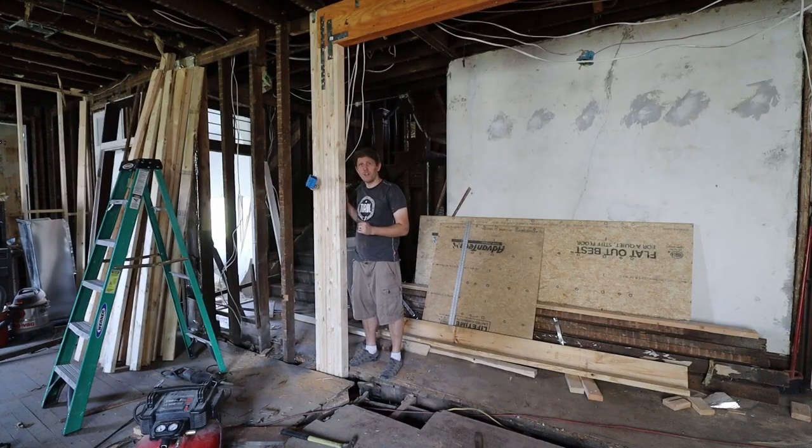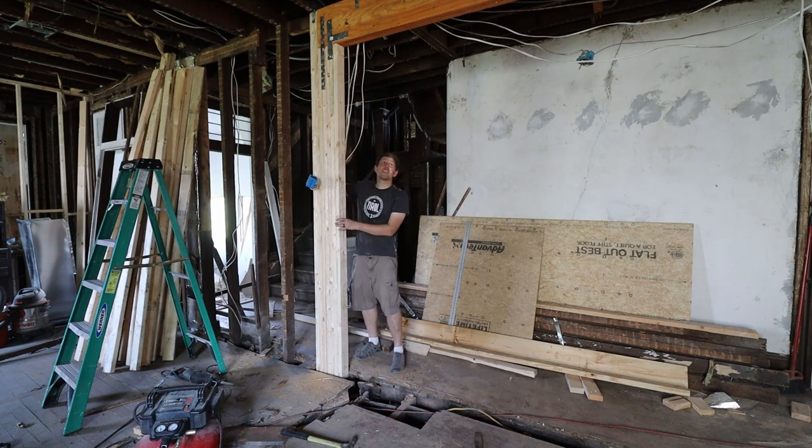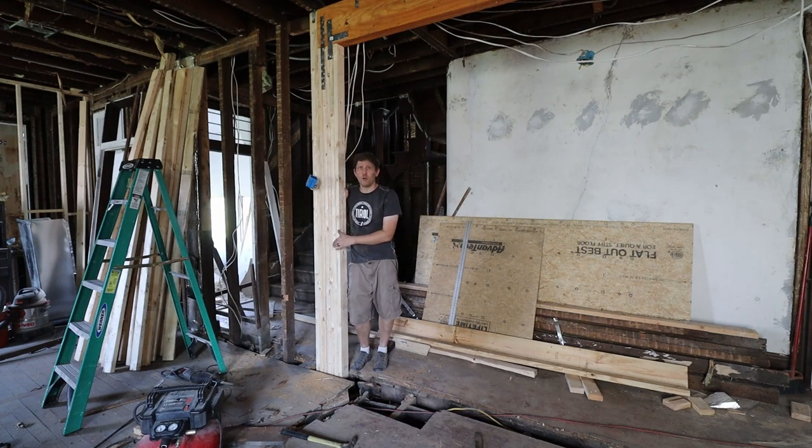One other important thing you have to do when you calculate one of those beams is you have to know the right width where the beam is going to sit. You can see here in this case I have five 2x4s on this side and four on the other side. We actually calculated with four of the 2x4s on each side, so 6 inches wide, but because I am sitting just right on the corner of a pillar below me, I put an extra one so that we are sitting a little bit more center on that pillar.